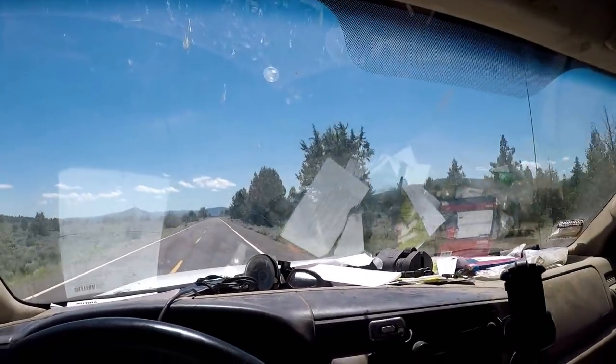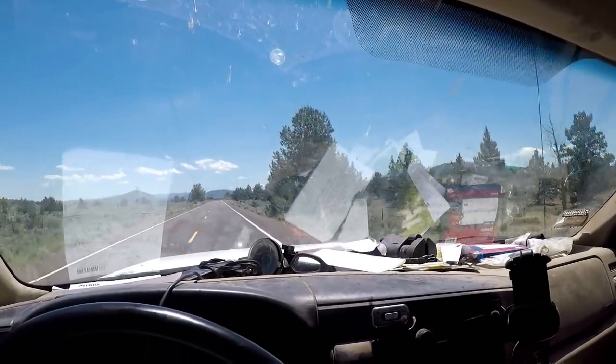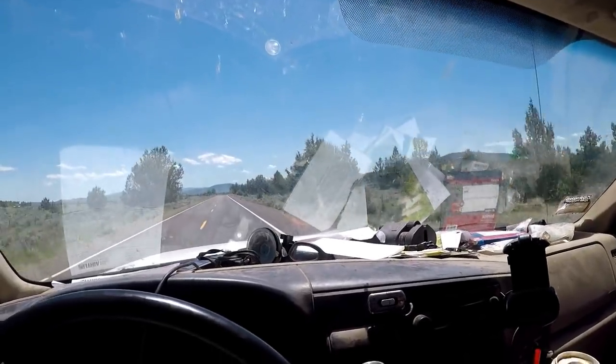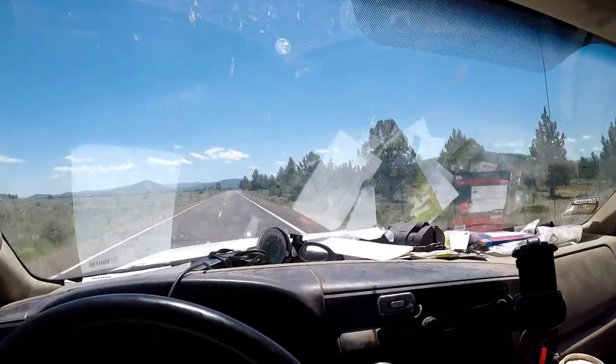We put a hitch control valve on it. I separated the stack again, put a hitch control valve on it like 2 months later when they got done using it, because they didn't want to park it. And that fixed it.